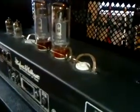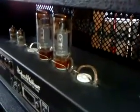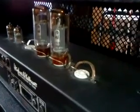Four have been removed. The bottom center pin on both of those tubes has broken off. I've just checked with Steve from Act 1 Music in Langley. He says not a big deal as long as you put the tubes back with the right spacings. There's this little notch in the center here. Don't know if you can see that. This lines up pins 1 and 8.